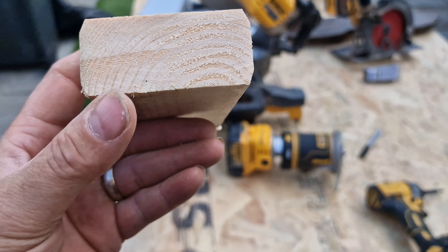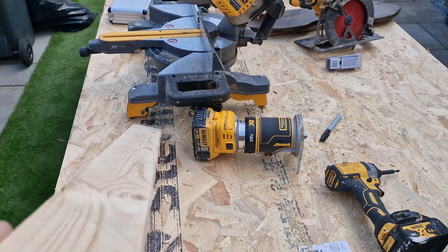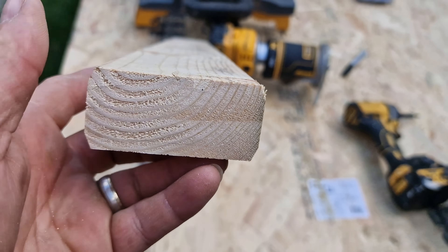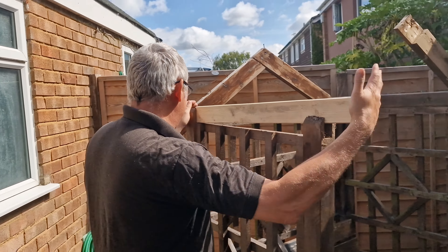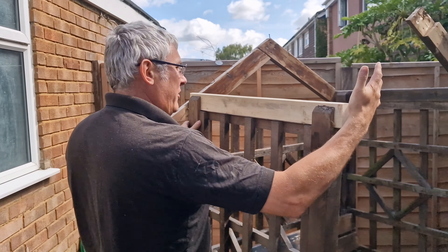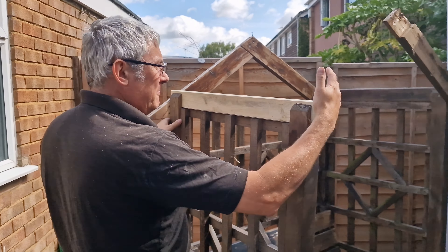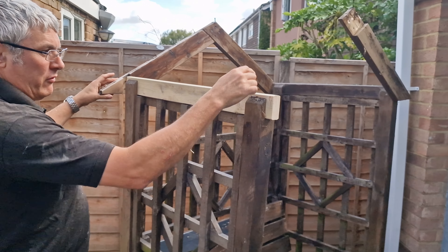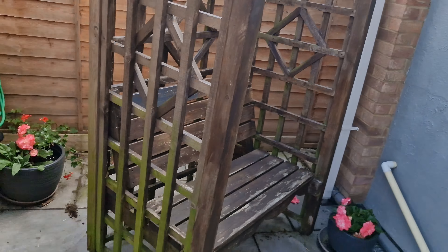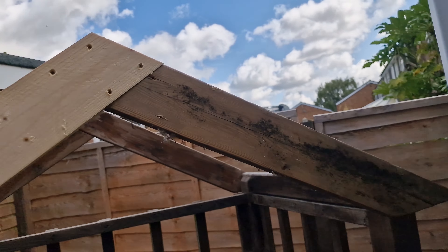So we've now got that ripped through, and we're going to round these edges off nicely with the router. We're going to use one of these bits — just an angled bit with a bearing guide just to chamfer all four sides of that. There you go guys, you can see it's a very very slight chamfer. It's not as big as the one that's already on the existing timber — I don't have a router bit any bigger than that, so that is what you're going to get. But it will do.